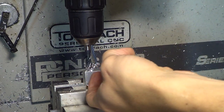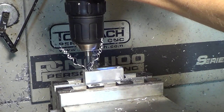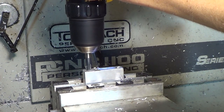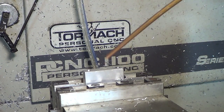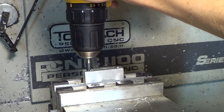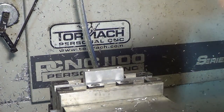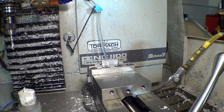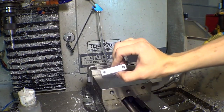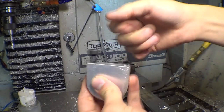You can see these chips are curling and pulling straight up out of the hole — that's the best part about spiral flute taps. Aluminum is a gummy metal so I use a little Ultra Lube for drill bits and taps. I back off every little bit just to break the chips so they're not too long. Done! Metric M8 fits right in.